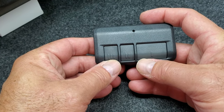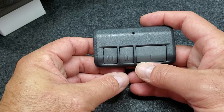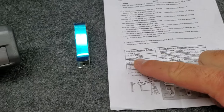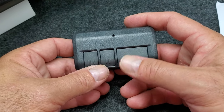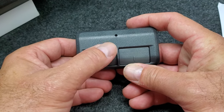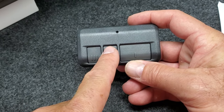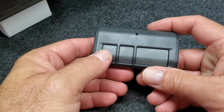If you have two separate garage door openers and one of them is on the red and the other you want to put on the purple, you follow the instructions here. The one for the purple is two times, and once for the red it's three times. So after opening the programming phase, you do one, two, three for the red button, and one, two for the purple button. Once that's done, you have the remote set — one for the red button, the other for the purple button. That's how you do two separate garage doors or even three.